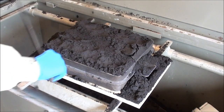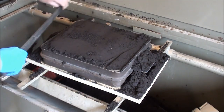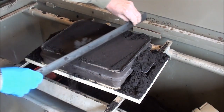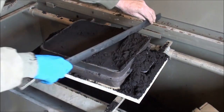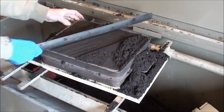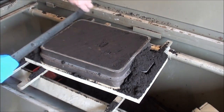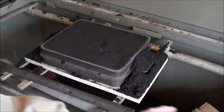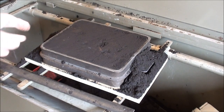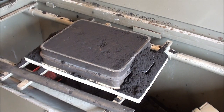It's rammed and now I will strike it. I'll take a little more sand in there. Did you notice how the whole flask slid on me? The reason it's doing that is because this is a Formica sink cutout with that fake granite there, and it's just as slick as can be — it was sliding on the bars here on the molding bench.